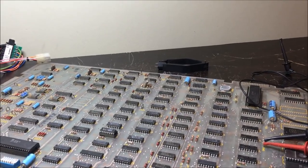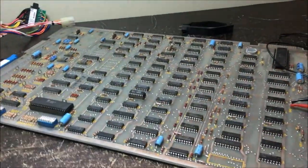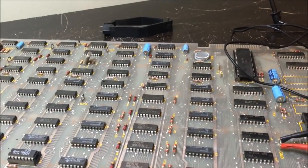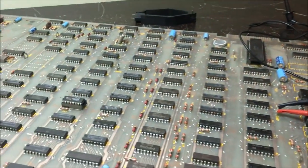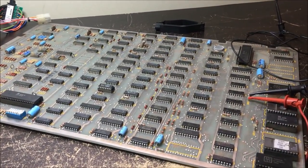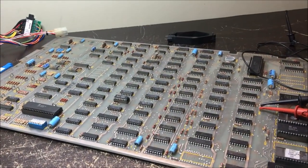It's working. So other than a little maintenance, I'm going to call this one good. I'm not going to bore you with the details - I'm going to replace all of the sockets and wash the board, clean it up. There's only a little bit of crust on this board, it's really not bad at all. I'll replace the power capacitors anyway. Easy one - hey, you need an easy one now and again. So just maintenance - it was a ROM, that was all that was wrong with it. I'll go ahead and clean it up, replace the sockets, and call it good.